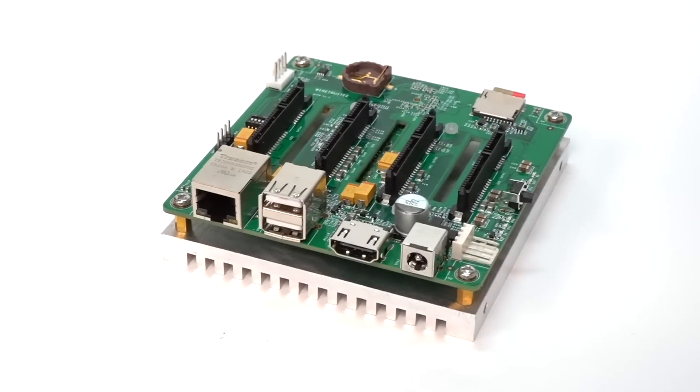I'm writing Raspberry Pi OS to a microSD card, putting it in, and then hopefully it'll boot up and start working. So we've got our three plugs to connect to the board. Plugging in SATA cables blind is not super easy, but we got those three in and the hard drives are connected. If you have the fourth drive in, you can tell these cables are a little tight, so with that fourth drive you might have to bend the cables a tiny bit to get them all to fit without kinking too much.